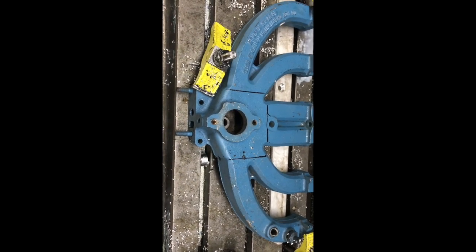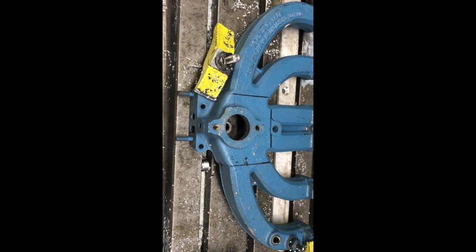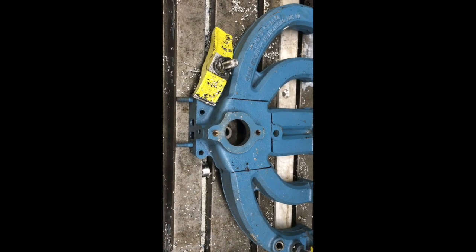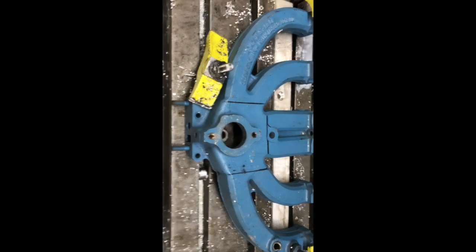Slant 6 single barrel, going to pocket mill and replace with a Holley Sniper 2 barrel. My machine is down 750 thousandths. Do a little plenum work and make a 2 barrel intake out of an aluminum stock slant 6 intake, single barrel.